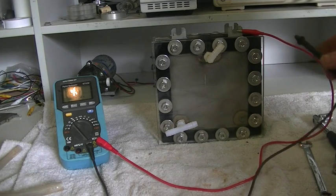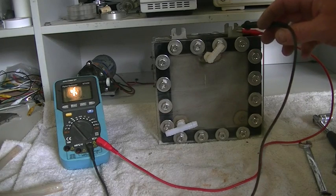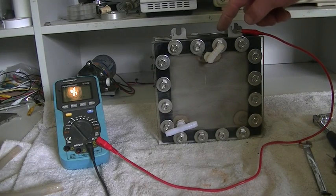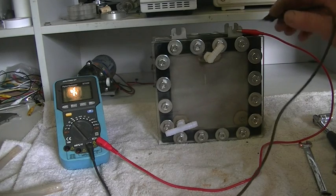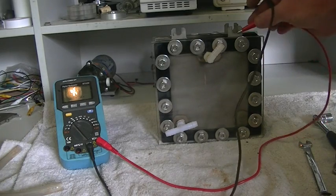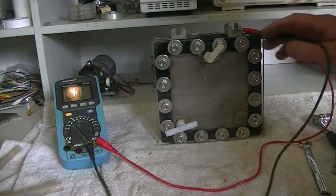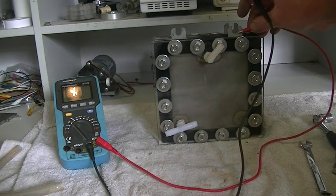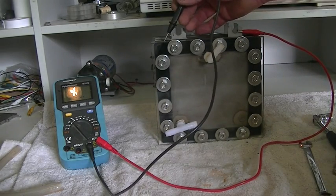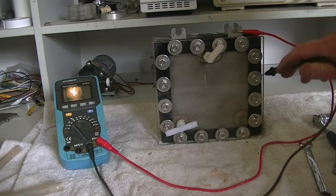What I'm going to do here is check between this end plate and all the bolts, which is the most likely place for a short, because all our bolts had rubber sleeves over them and the rubber sleeves ended very close to this end plate. We've got our digital multimeter set on the continuity test — it gives us a little beep if there is a short. So if we put it on the end plate over here we can hear our short. I'm just going to check between the end plate and all the bolts.